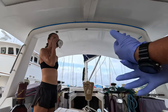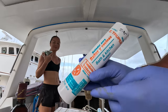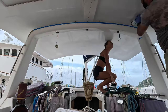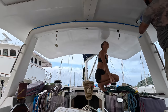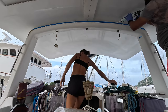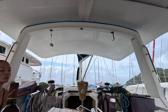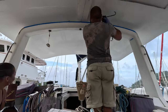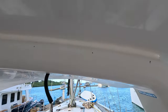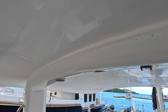After drilling the hole you can see the interior surface clearly — it is flat. Now we need to put a large amount of silicone between the hard top and arc. It's very important to use silicone with an anti-fungi mark to prevent mold. We used about 10 bottles of silicone, filling a gap of about one and a half centimeters. The results look perfect — small holes from screws will be covered with gel coat later.